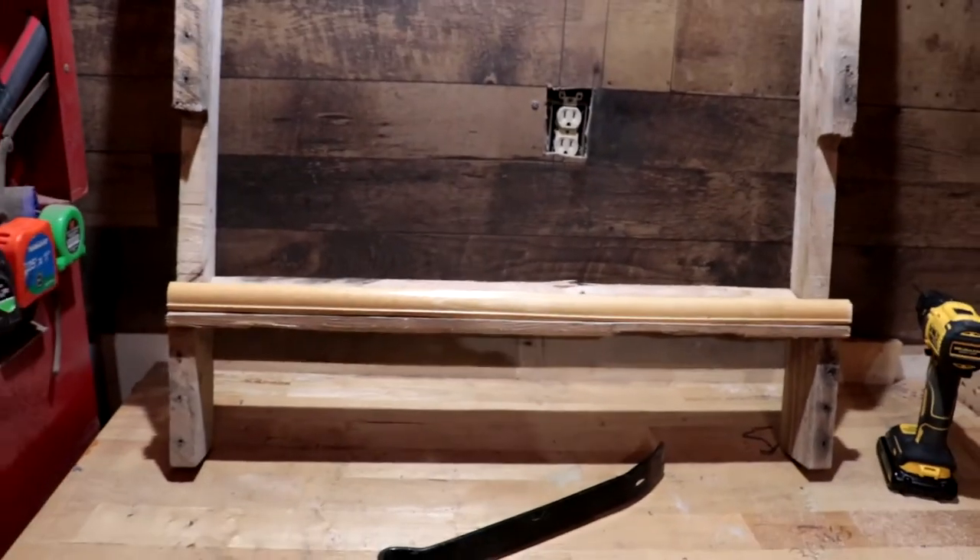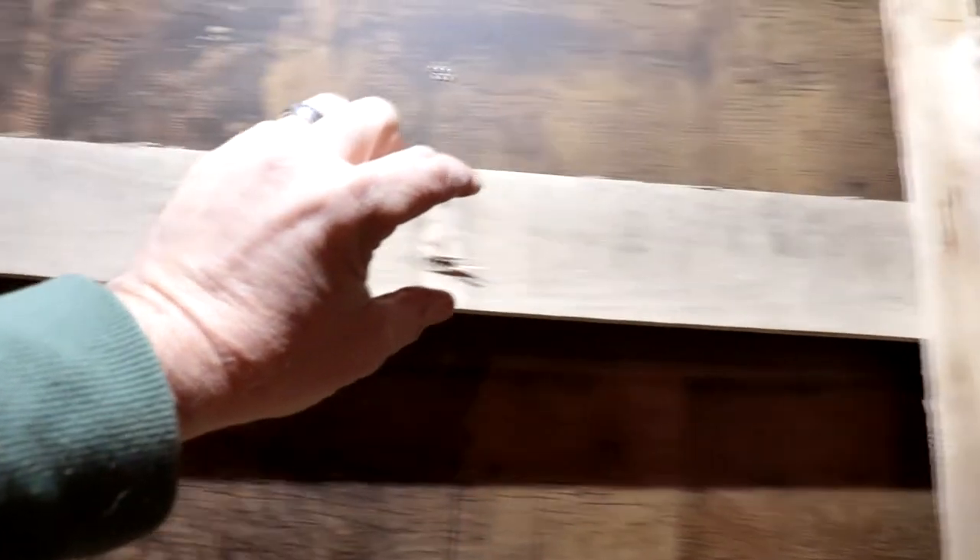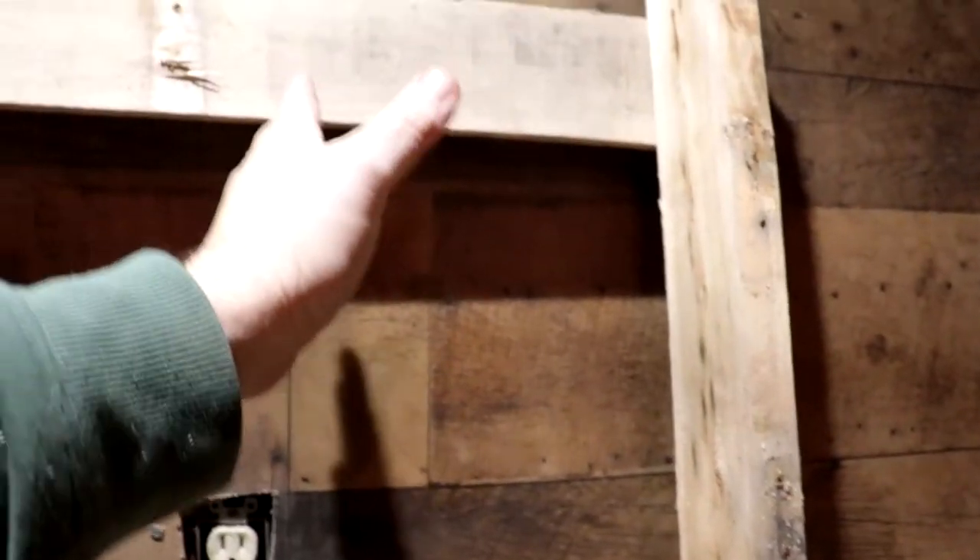Here's a quick look at where we're at. Remember, we're trying to do this for zero dollars. This lip down here is where the butt of the rod goes, we have a bracket going across halfway up, and the rod will sit inside that bracket. Once I get a piece going across the top I'm gonna sand the whole thing down, paint it, screw it to the wall, and I'll have a place to put the rods — get them off the floor, don't break any, and get organized.